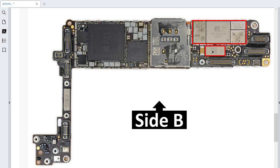That's why near this inductor, we have the display and touch connector. If this connector is also damaged, there will be no display and no touch on the screen. Over here we have basically one of the most important components on Side B — this is the BB CPU. If the CPU has failed, you will get automatic restart and boot-up error messages. Some subtle symptoms include low sounds, no sounds, no signals during calls.